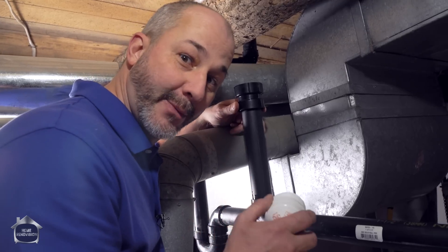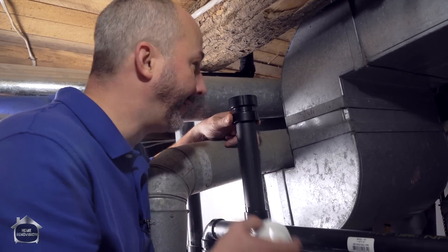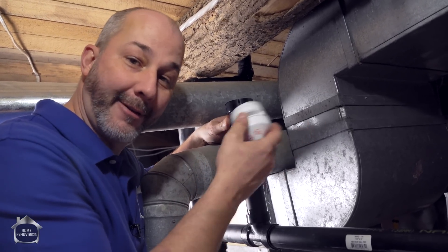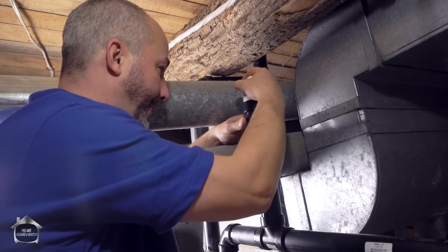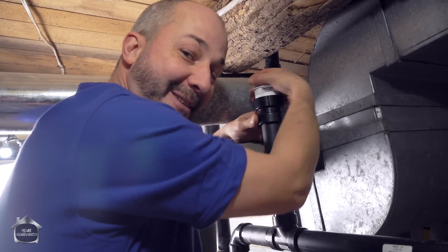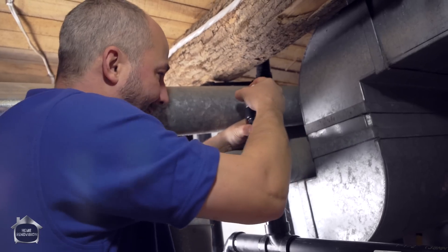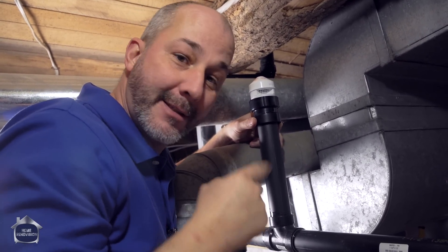In my situation in this crazy basement, I'm going to be bringing my laundry sink and connecting it to my Saniflo macerator. In this case, this valve needs to be installed higher than the laundry sink, which is easy because it can just go right here near the ceiling. If you have a house that's an 1880 farmhouse with trees as a foundation, you'd appreciate why these things are so valuable. We just put Teflon tape on it and thread it right into the connection — now we're good to go. All I've got to do is pipe it all back into the Saniflo.